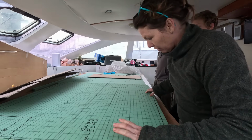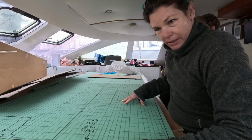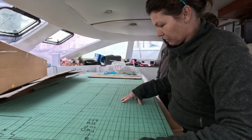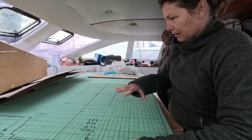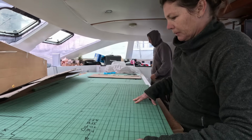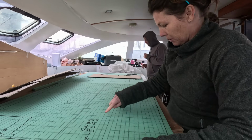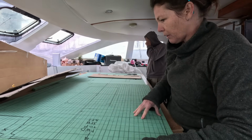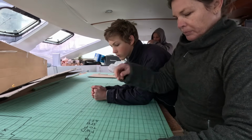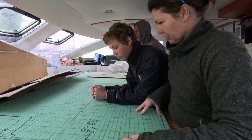So it's a little bit of rinse and repeat at the moment, isn't it? Lots. The kids template the floor. Aiden usually is templating the next section of floor, then marks it out on the 20mm foam. Then mark all of the holes to drill through. Oh, you missed a couple, Oliver. Yeah, there's a couple there you've missed. That's to allow the resin transfer when it's infused.